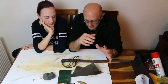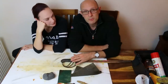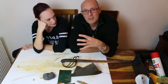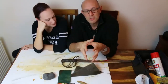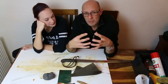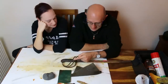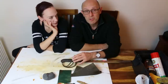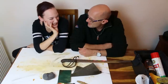And that's the other thing to say, is you do get different levels of rust and types of rust. And I have found rust can form on things which have dirt on them. So if you have a dirty piece of steel that then gets rust on it, the dirt almost forms a protective layer between the metal and the rust, and it makes it easier to remove the rust. And some rust seems very deep. Some rust comes in different colours and can be very, very hard, almost immobile in some cases. Red rust, which this is, it's kind of light brown colour, it seems to be the most easily treatable and the most easily removable, and it's what I refer to as light rust. I never thought I could waffle on for so long about rust and rust removal.